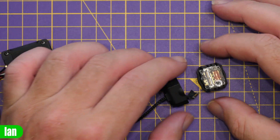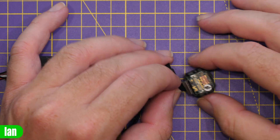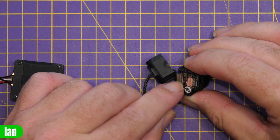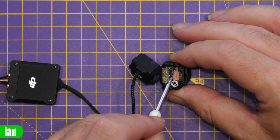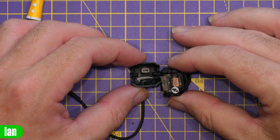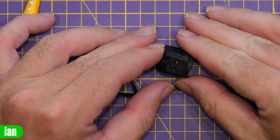Refitting is the opposite of removal — simply take the cable and fit it onto the new camera. You can replace the camera module with a brand new one or take one off another air unit. Push the cable in place and gently press down. Before putting the back shell on, I'd recommend squeezing the heat compound into the edges to make sure it hasn't spread too much, as that helps with camera cooling. Then place the shell back over the rear and reinstall the two screws. At this point you've done the hardware change, but it's now time to do the calibration.